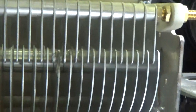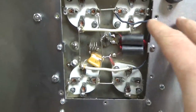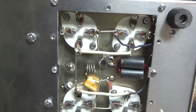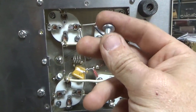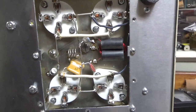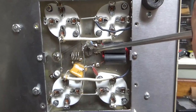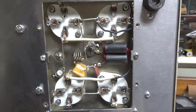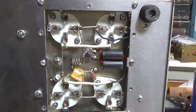It'll be better than new when I'm done. Here's the bottom of the tube sockets — added the two gas discharge tubes, one here and one over here. I always change the screw from the short one to a longer one, because they usually back out and then the tube can fall sideways and get damaged. It was missing the internal tooth lock washer, so I installed one. Pressed the socket clips, cleaned them with Deoxit Gold, and that's it.